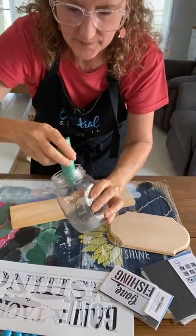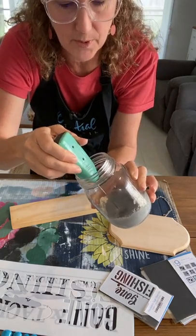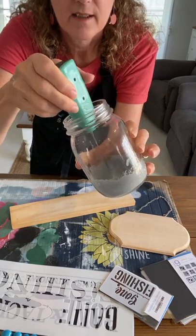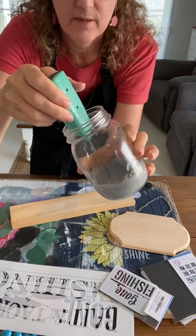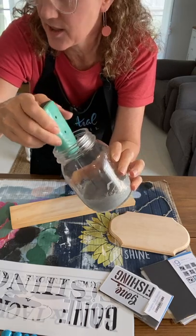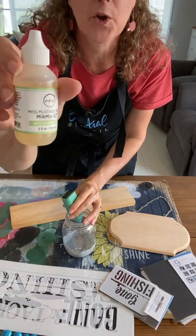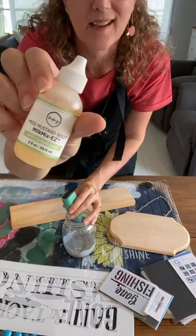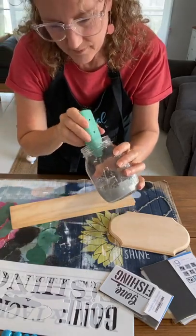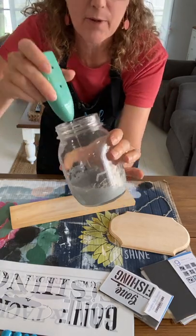Mixing it around with the whisk without turning it on yet, just until all the little lumps dissolve. It's a lovely grey color. I'm going to turn the frother on now, but be careful not to splatter it everywhere — just let it bump the bottom of the jar gently. Miss Mustard Seed's milk paint now has a 'Milk Mix Ease' anti-foaming agent; just a drop or two takes away bubbles, but usually you can just brush them out.